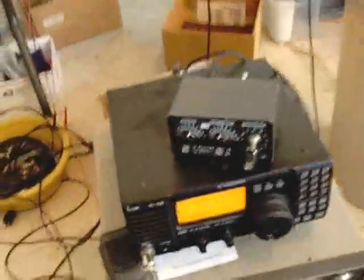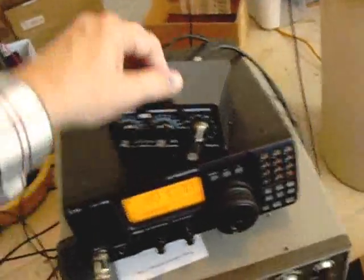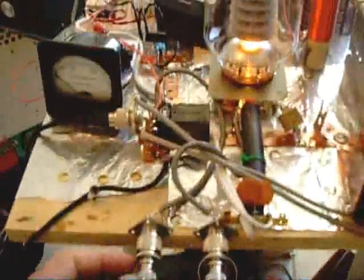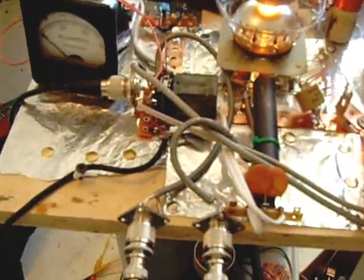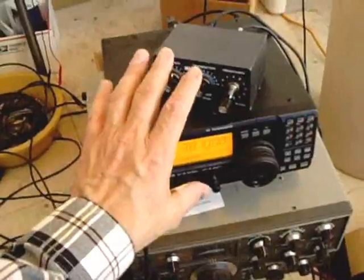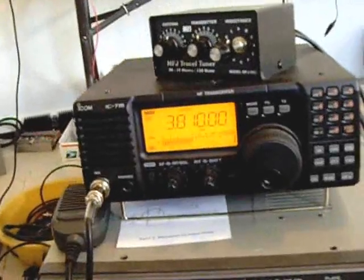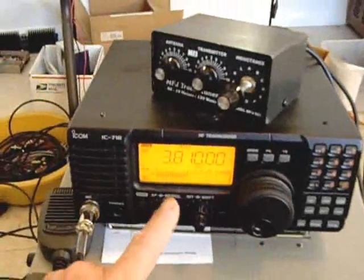I'll explain the input circuit to the amplifier. I've chosen to use an antenna tuner — this MFJ antenna tuner here — for the input circuit. I've used two cables, one in and one out, which go between the cathode input of this amplifier tube. And I can tune it to get the SWR down on the rig so the impedance match for the rig matches that of the amplifier. The rig is an ICOM IC718 right now. I also own my favorite rig, a Kenwood TS520, which has tube outputs, but for testing purposes I'm using the IC718 today.